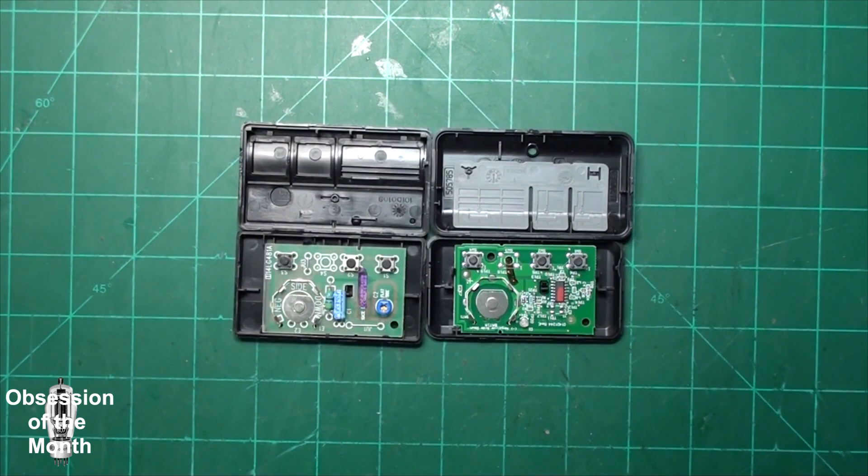I used my SDR radio and walked around the house looking for interference on 315 MHz — there was none. Monitoring with a wider-bandwidth SDR for hours, I would occasionally see what appeared to be other 315 MHz devices, possibly other garage doors in the neighborhood, but these triggered very infrequently and were nowhere near the garage door. There's an Air Force Base nearby that transmits around 300 MHz — nothing from them on 315 MHz either.